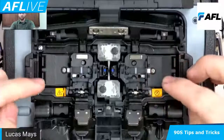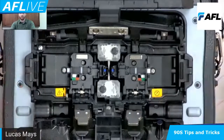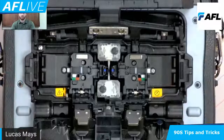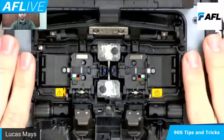These little arms are actually what keep the fiber secure after the sheath clamps open automatically, so that the fiber doesn't pop out by mistake or slide on you too bad. When you're initially opening the machine to use for the first time, you'll have to individually raise these — no big deal, like so. But as soon as you get going, you'll have your fibers in there, they'll splice, and when you lift, those will simply lift because they are just a gentle secure.